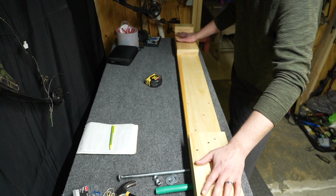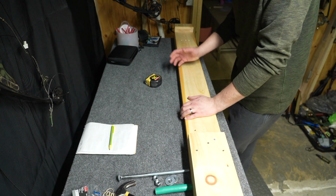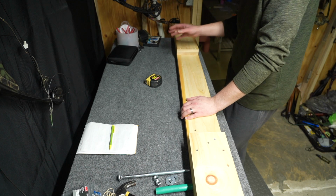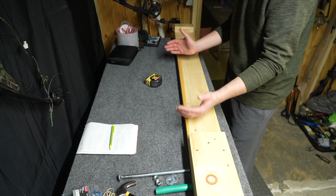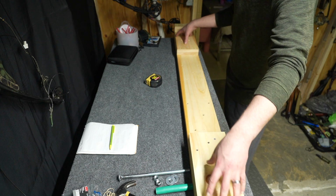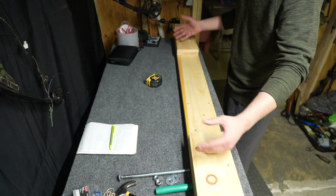And this is of course the underside. I've seen some people make draw boards out of 2x4s or just 2x8s plain as it is. They might work out okay. I'd be afraid that you might get a little bit of bowing in the center with a 2x4, and I really like just having that extra peace of mind. And if you buy an 8-foot board, you're going to have to cut it off anyway.